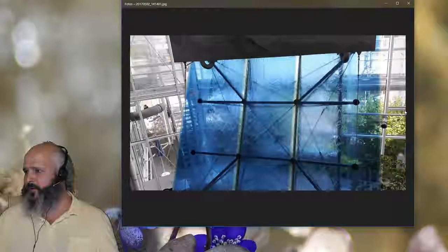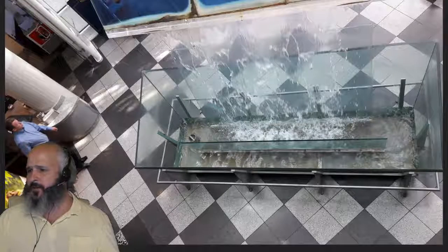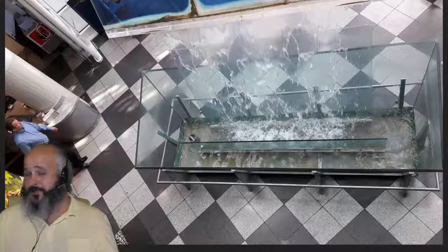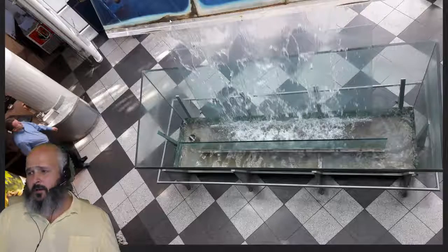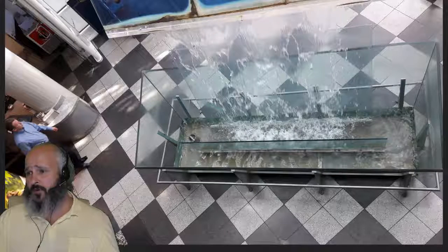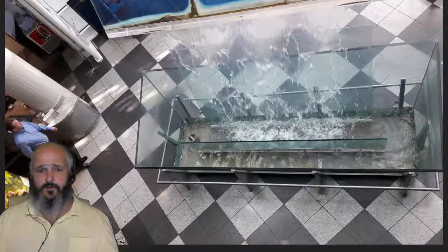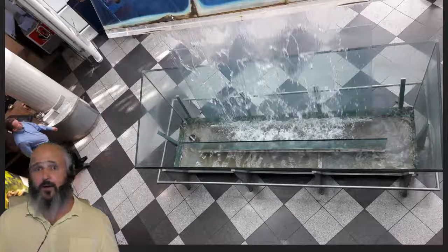And you can see the dirt here too, and that's a pity. So I think that the guys who have built this water feature, they didn't know about the cape rule, because if you don't have a proper filter system, all the dirt and all the lime is going to stick to the glass, and if you have corners and edges and holes and niches, then it will stay there. So it's really important to have a proper dirt filtering, and it's important to avoid calcification and lime, and it is important to take care of algae and germs.